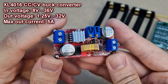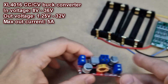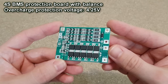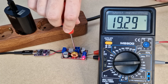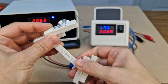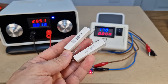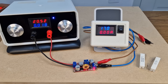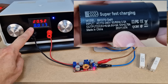We need a constant current constant voltage step-down converter, which can limit the current — otherwise you will destroy the lithium-ion cells. This one can handle up to 5 amps and I've also added a small heatsink on the IC. The charging voltage needs to be a little higher, so at least one cell will reach the cutoff voltage, which for this BMS board is 4.25 volts. I will adjust the output voltage of the converter to almost 17 volts. I need a load to limit the charging current, and I also need to pay attention to the current consumption from the charger. My DIY variable power supply will represent the charger, set to 20 volts, and it must not exceed 1.67 amps.